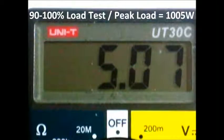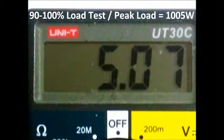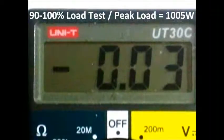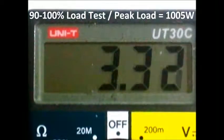We reached that much load with just two cards. What we did was overclock our X79 system and pumped in 1.48 volts there. Now we are going to move to the 3.3 volts — and there we go.